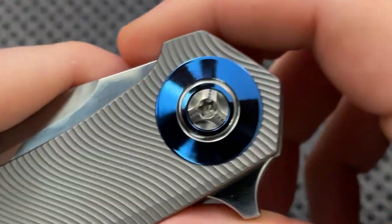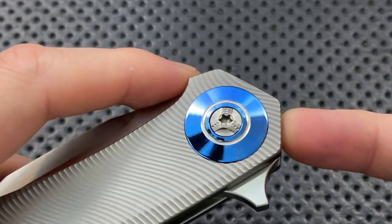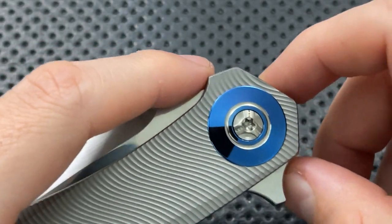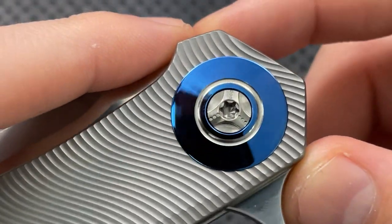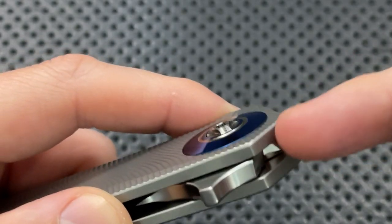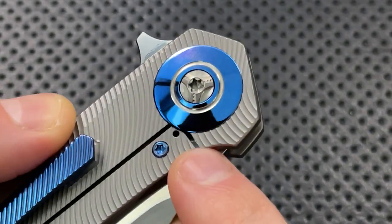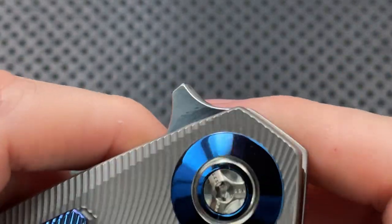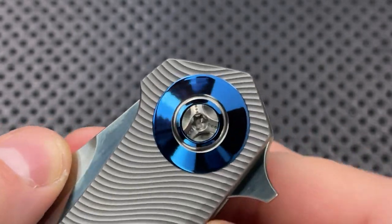If we look at the pivot collar here, this is an anodized — I think 27 volt — and I've kind of determined this is my favorite titanium anodization color. The path to my heart is about 27 volts worth of titanium anodization. They've done a nice job here with this Captain America-style pivot shield. This pivot shield actually serves two purposes: the stop pin is actually held in place by it, and also on the backside, having the symmetrically large pivot shield here is serving as an over-travel stop on the lock bar. No arguments there — that's good. And it's very, very nice high polish on this guy.